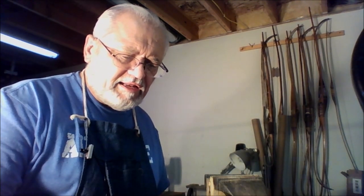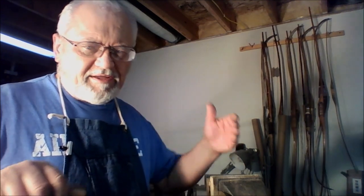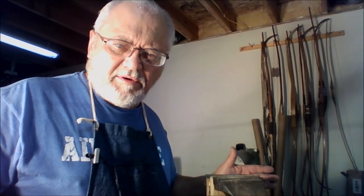Those are two pieces that we spent a few minutes on, and we've got those brought up to where we want them. I went online and I ordered a buttstock and a pump handle for this, as well as new magazine tubes — both the inner and outer magazine tubes — with Brownells; got all of that stuff ordered. And the reason for that was when I cleaned up the other magazine tubes, what I found is they were bent. And it's hard to straighten a tube. The inner doesn't want to go into the outer tube because the outer tube has been bent; the inner tube has been bent also. So we were getting into big problems, and we went ahead and ordered some new ones of those.